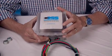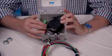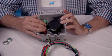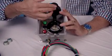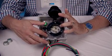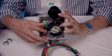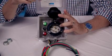Your natural disaster comes, the green light, utility power, is not on. Engage to off. Start up your generator. Plug it into the inlet. The red light will flicker a little bit, to get that dirty power out of the generator. Engage the generator power. Now you're running.